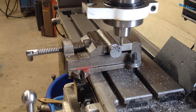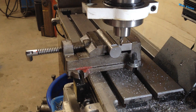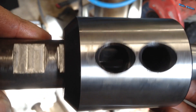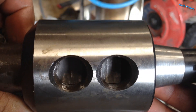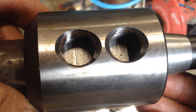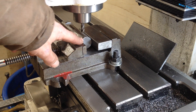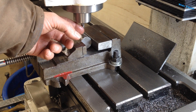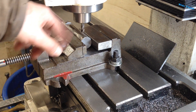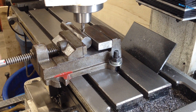I'm going to first square the ends on this shaft. To make these two spots, all I'm going to do is stick this up in here, now that both ends are square, make sure it bottoms out, and tighten them up. Yeah, I can see the two marks. Barely there, but I see them. A combination of this end mill and those two marks will be good. So that's where I'm going to make the flats; we'll do the other flat off camera. It's a perfect fit in there — I am very happy with that. I found the end of the shaft and came over half an inch. There's a half inch from this end of the cutter to the end of the shaft, so that gives me a half inch below my bit. I'm going to make a flat spot there, an eighth of an inch deep.